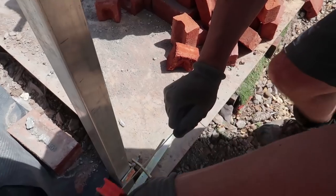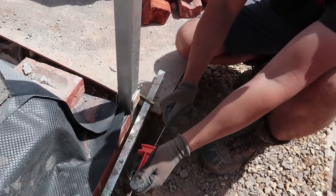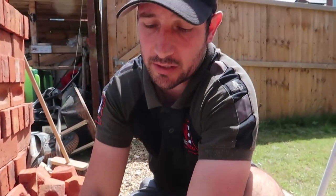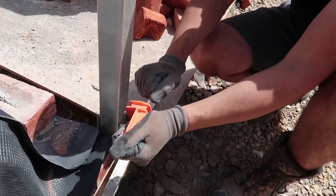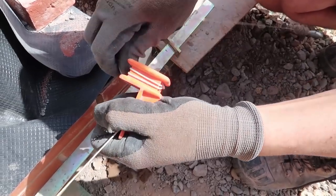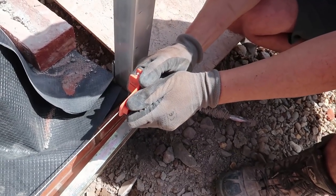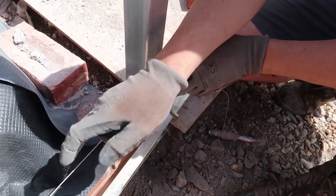Alright, we've got plenty on. Now the thing is you want your lines nice and tight — nice and tight like a tiger. I generally pull it tight and then a brick and a half. Actually it depends on the line — this is new line so it's quite solid, so I'm going to go half a brick. When it snaps tight, do again figure-of-eights, snap it in place a couple of times, and give it a couple of wraps. Be careful because you don't want that knocking your teeth out — get it with both hands. Give it a pull and then on the corner block. And we want it to make a nice twang — do you hear that twang? That's what we want.